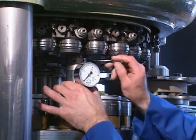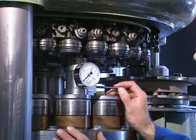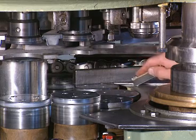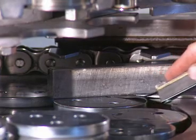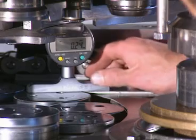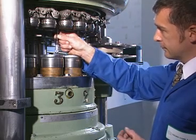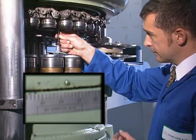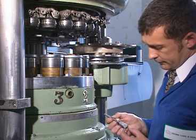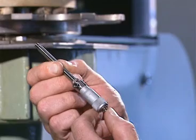Next, set the base loads to a target figure. Loads depend upon the machine type and components being used. The lifter height should then be set relative to the infeed table wear plate — ensure that all the lifters are below the infeed table by at least eight thousandths of an inch or 0.2 millimetres, depending on seamer type and running speed. Now set the machine pin height at the peak of the first operation seaming cam. Recommended pin heights are found on the specification sheets. The final adjustment should be in an upward direction to eliminate any backlash in the elevating mechanism.